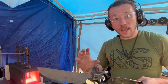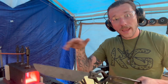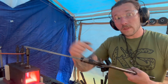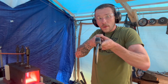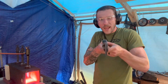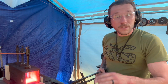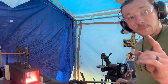When it's in that critical orange temperature it's in its plastic state and it'll move and bend under its own weight in the tongs, because that's a fulcrum point where it's locked in. It can bend at the tang or bend under its own weight along the spine. Right now we're pretty straight — look right down the point. If it's got a slight warp as it's cooling, that's perfectly okay because we can straighten that out during our normalizing cycles and right before we quench. Right now I have the oil heating up.